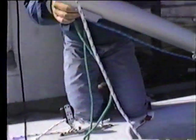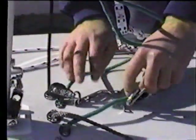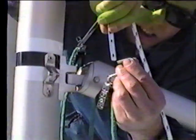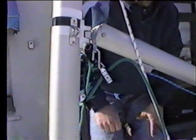Next we're going to go with the hookup of the cunningham and the vang. Here's the green cunningham rope — I'm going to uncleat that. Here's the red vang rope. Tim is going to show us first how we hook up the cunningham. The cunningham is going to be visualized up at the front as the green rope coming through the through-decks. On that rope there is a single pulley surrounded by two other pulleys. You want the middle pulley, and you're going to put it through the small fitting on the mast — that small fitting is about five inches below your boom. It goes on there with a ring. Then take your other two pulleys — there's a hook end and a bail end — and that makes your two-to-one cunningham system. Leave it sitting right there on the boom since there's no sail on.